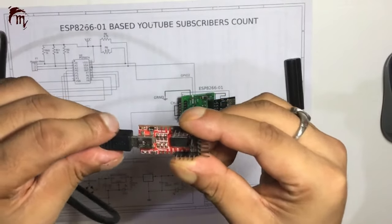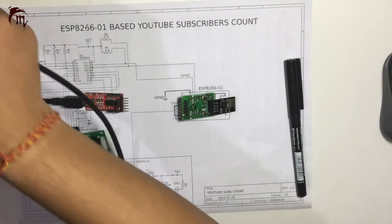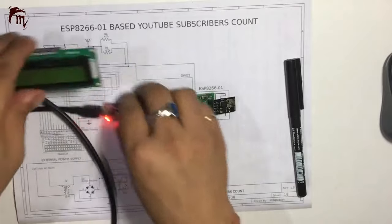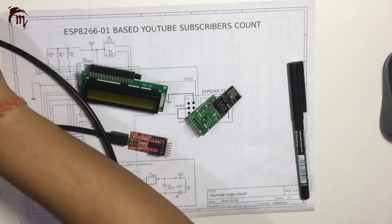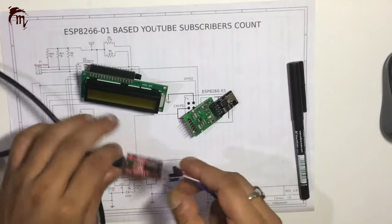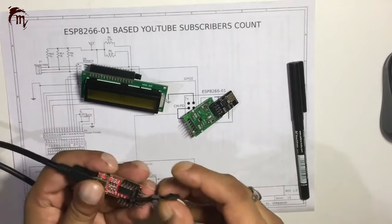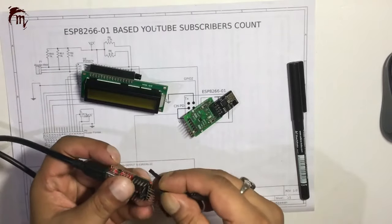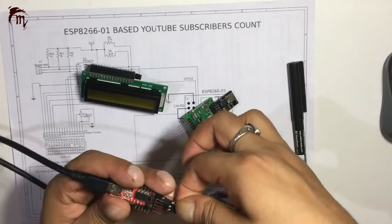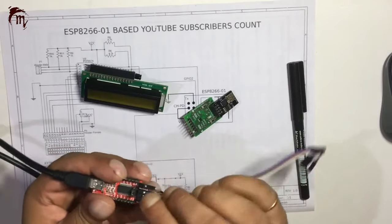So let's start making our circuit. Let's connect this one. Let me disconnect it. So here you need VCC, ground, and TX and RX. Your ground is the first pin, this one, then your VCC, then your TX, then RX.